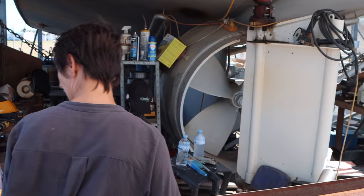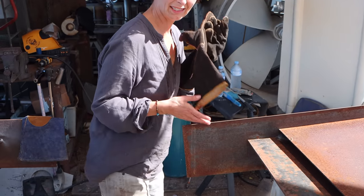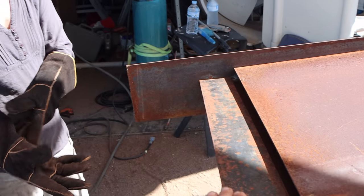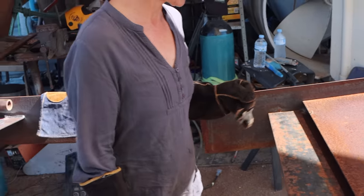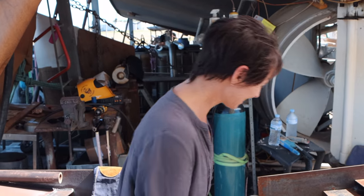Oh, you're going to go after the fact? Yeah. Okay, that's fine. I just wanted to make sure you're doing a weld there. Yeah, the reason I haven't welded it now is because I want this plate to tuck right up into it. And you'll do it over the top. Yeah. I was thinking, I don't trust that little tack. No. It's a sad little tack.